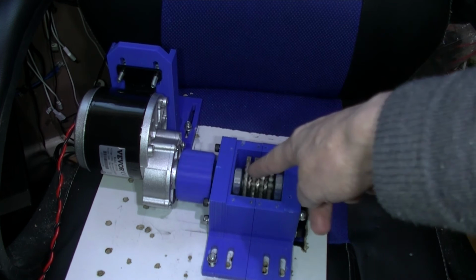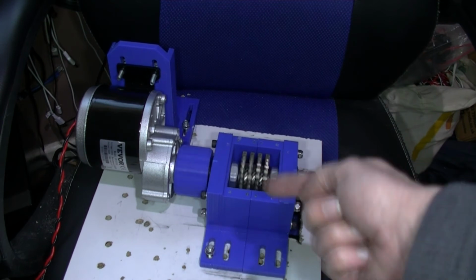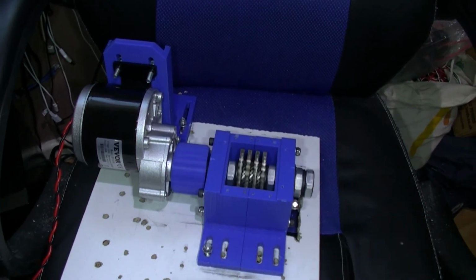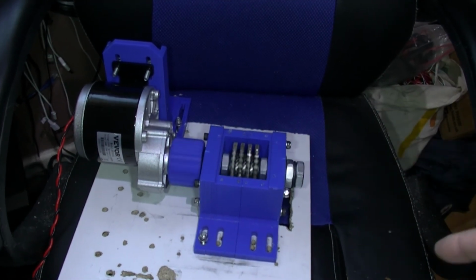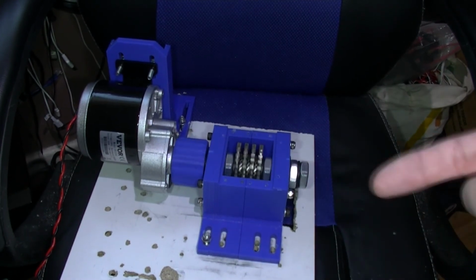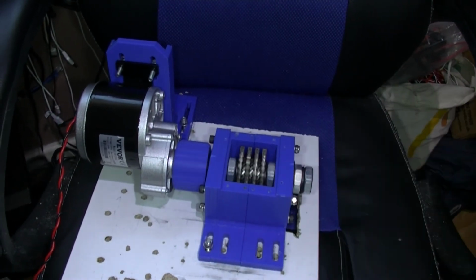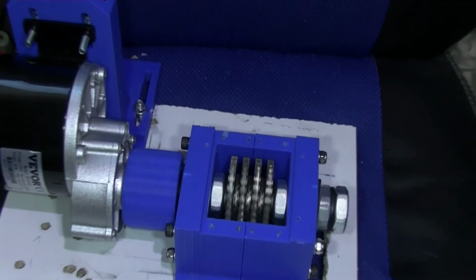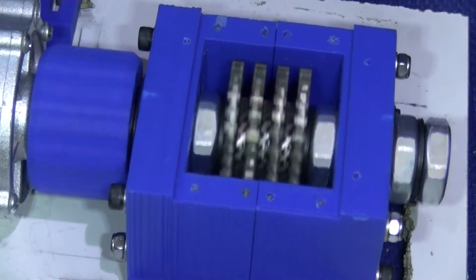So I'm hoping that doing this will get those two big half nuts there wearing the plastic edge down a bit. And then I'm going to tighten up these longer nuts, these 6mm nuts there, when it's turned off, obviously. I let it run like this for about 10 minutes, and then I'll tighten it up a bit, another 10 minutes, tighten it up a bit until this is totally tight, and hopefully there's still enough loose to turn. Sorry about the strobing there.